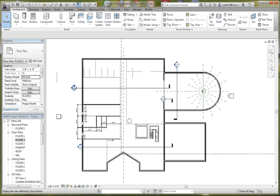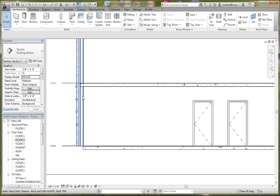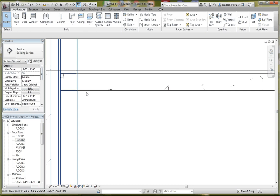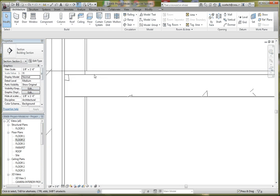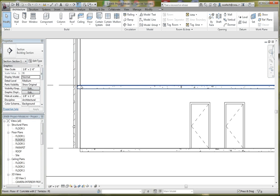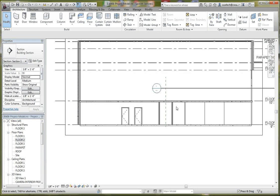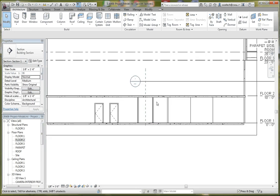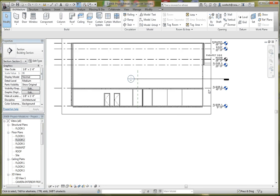Let's go back to our section view to look at our floors. Down at the first floor we avoided the structure, but here the foundation structure supports the wall which now supports the floor. The floor is built down, so the wall supports it and the floor truncates into that wall. The terrazzo tile works its way around the structure so it doesn't go into the second floor wall portion. These walls now terminate at the bottom of the floor, which was our first question.